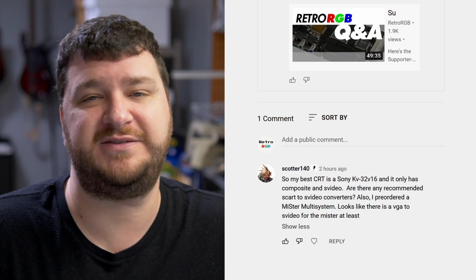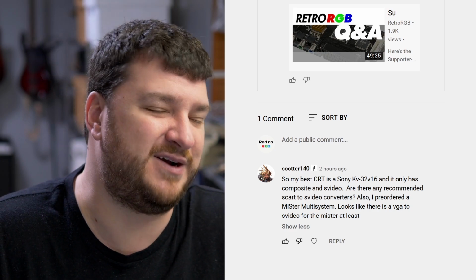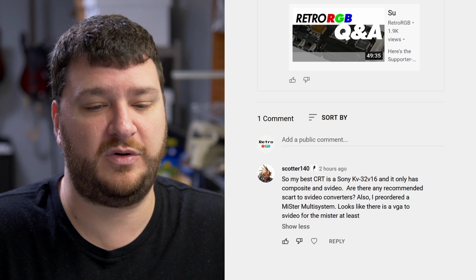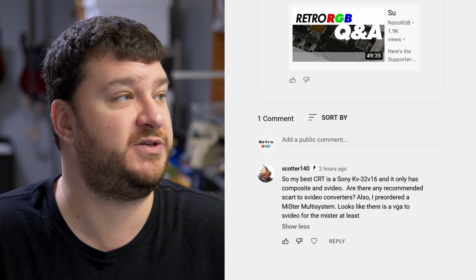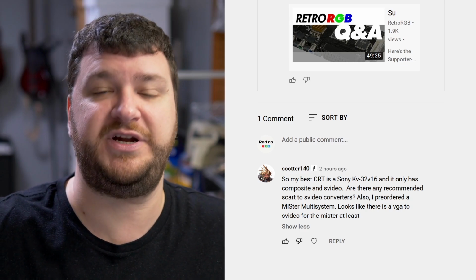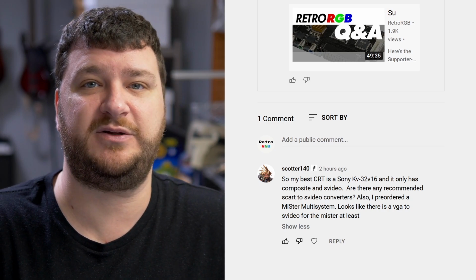But if you're bouncing between 10 different cores and arcade boards and things that don't always have color bar patterns, it's going to be a little trickier. So a bunch of us are looking into ways to get composite video from the MiSTer, from all of these original consoles originating from RGB for all the reasons we just discussed. But it's a little harder than you'd think.